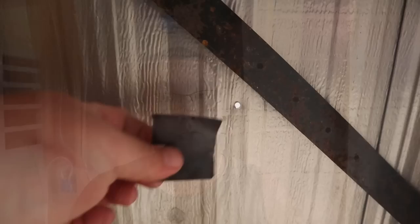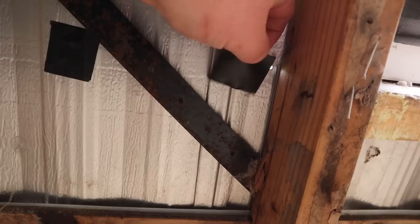As some of you may have noticed in our last video, there are some holes in the siding on the wall we've been working on. We are aware of those — many have been filled with clear Lexel caulk, but some have not, so we're going to put Gorilla tape on the inside to seal up those holes as a temporary fix while we plan to re-side the home in the near future. Next I'm going to take my oscillating tool and trim up some drywall torn around the edges and remove staples to prepare the walls for drywall.